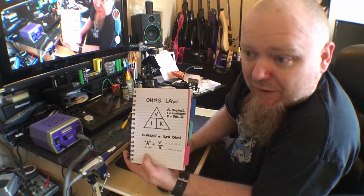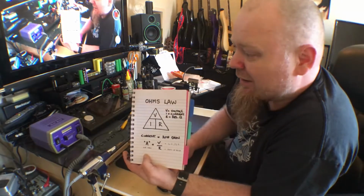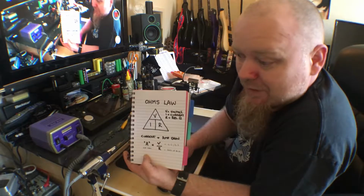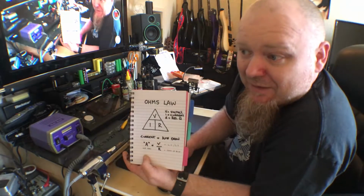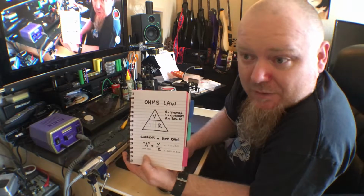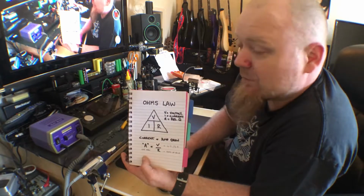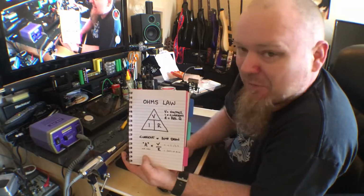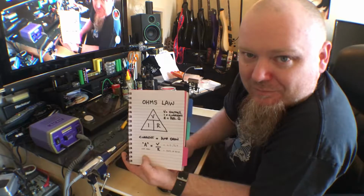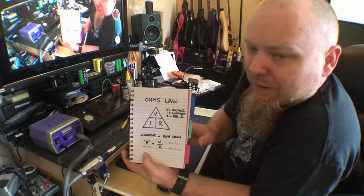Sony VTC 5A is pretty much the industry standard battery. They are safe to use, obviously with it being Sony, it's a big company. There are clones out there, but if you're buying from places like Juice Cabin or Cabin Mods, they are genuine batteries. It's worth having them. Some of the cheaper ones you can find might be for a flashlight and have a 10 amp discharge limit. If you try to put that in a mod, you're going to be on fire pretty soon, and you don't want that.